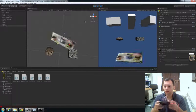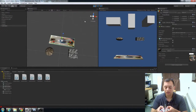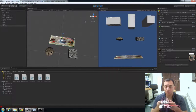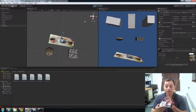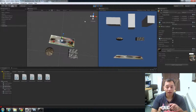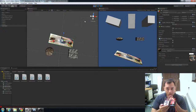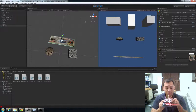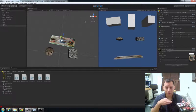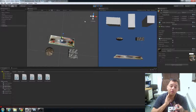Again, just look at the cubes at the top, not the one on the bottom. It also recognizes that with respect to gravity that it's turning. Now, the issue I have right now is if you look at my third shape, the Z, the axis that is parallel to the pull of gravity, then you notice that if I'm very careful, you're not seeing any change in that axis. That's because regardless of how I rotate along the XY plane, there's no real change in acceleration or gravitational pull on the Z axis.